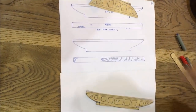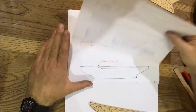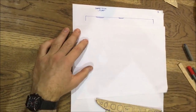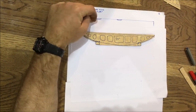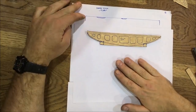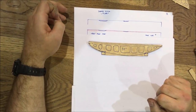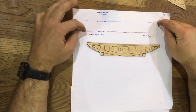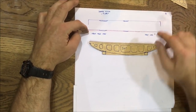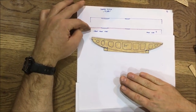The next stage was to decide how to go about attacking it. So if you're looking at the cross section of the straight edge, I've got pitting in this section and pitting in the middle. One option, which would have been based around taking the minimum amount of material away, would have been to take very little off this end and the maximum off this end. Which at the time seemed like a good plan.